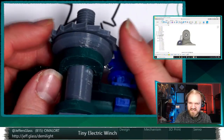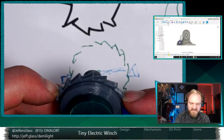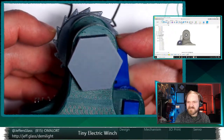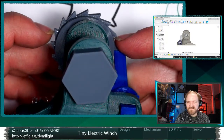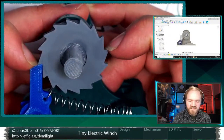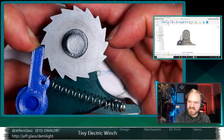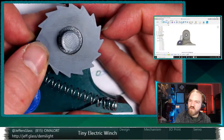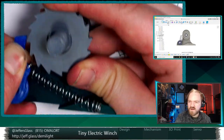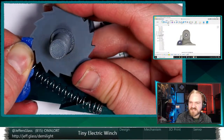But somehow, the idea of a spring that is not acting so much on the frame and an arm, but on two arms of the ratchet itself. And then, is there a way that we could design it quite cleverly so that, and now I really am just making things up, but to your point, Chris, about angular resolution, what if the arms were not perfectly symmetrical across the shaft, in this slot and this tooth, right? They'd be opposite sides. What if one of the teeth was slightly offset so that when the first pawl clears, the ratchet only rotates half a tooth's rotation, and this pawl stalls here, and then when this imaginary pawl gets cleared, this ratchets into place.